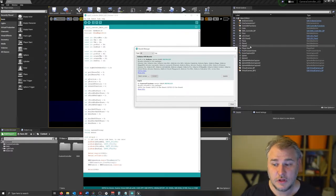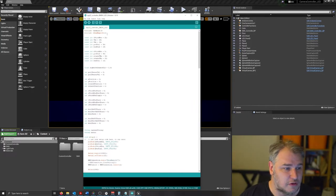But with that installed, we've also added the library, BlueMagic32, you can see this here. And one thing you'll notice, if you've had a look at the previous version, is all of this is pretty straightforward. We've changed the pins, because the pins needed to be those six pins designated only for Bluetooth. You'll find that if you have a look at the pin types. But the rest is pretty much similar. We've got an extra float here, and we'll go through that.